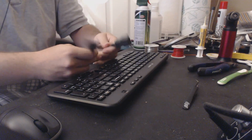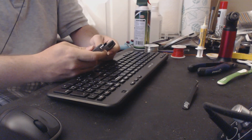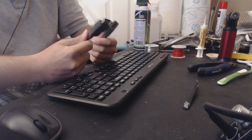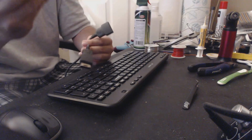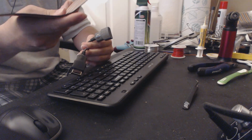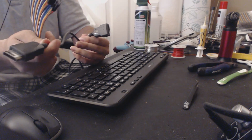Today I will be showing how to make a Sega Saturn splice cable to be used with RetroSpy, which is an input displaying program. Basically, the goal of this is to cut this cable apart and then splice these wires into the connections in the cable, so that these wires can go to a microcontroller, and then you can continue to send the controller to your console.